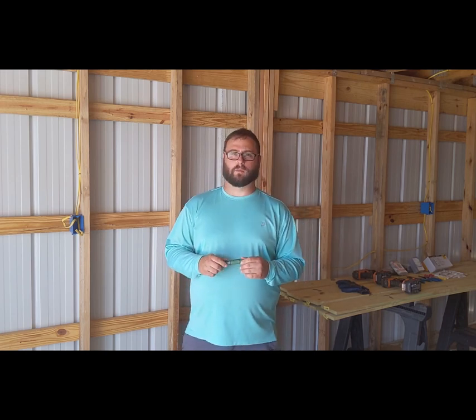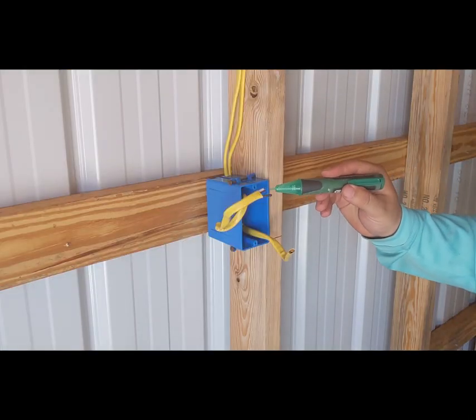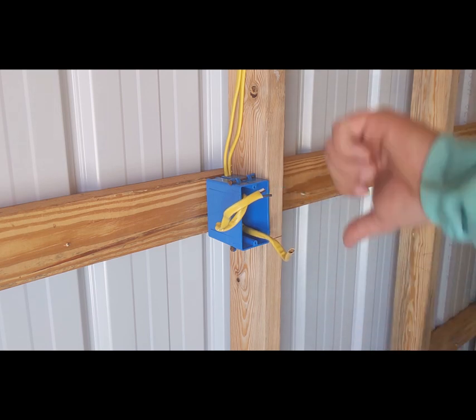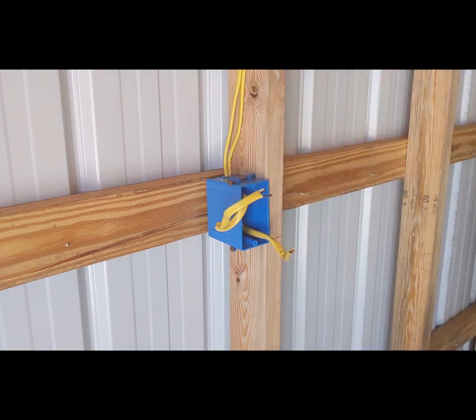We have got our tools and material together. We now want to go ahead and start the very basic procedures that anybody needs to follow before doing any kind of electrical work whatsoever. The goal here is not to be scared of working on it, but to respect it and be able to work with it properly. So first step, we're going to take our tick tester right here, and we're going to go to the device or outlet or whatever piece of equipment we're going to be working on, and we're going to test it to see if it's hot or if it's de-energized.